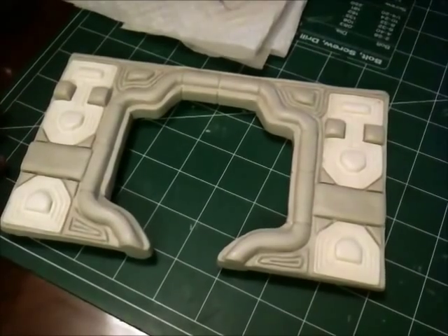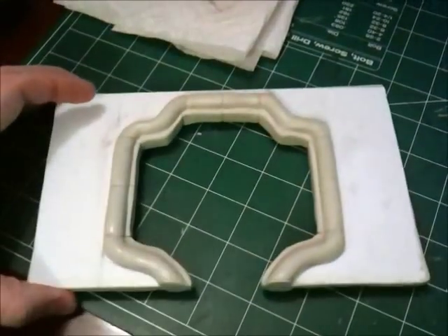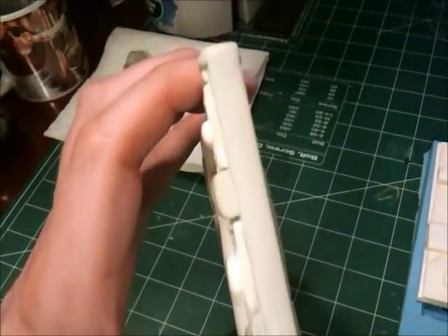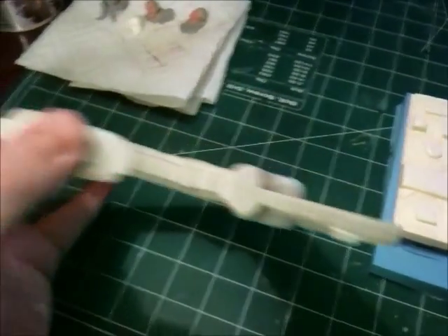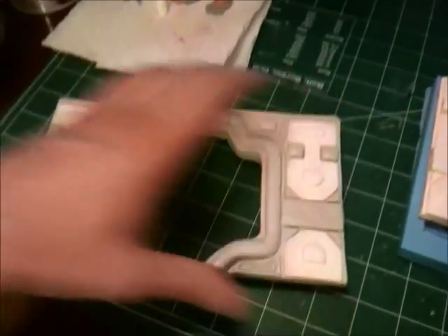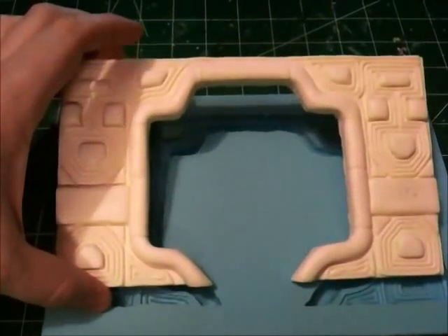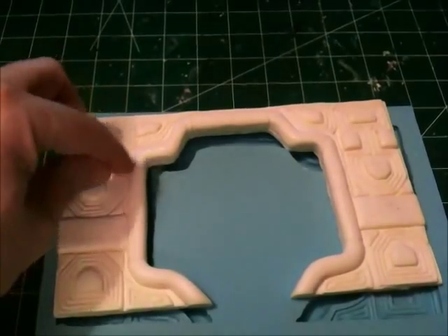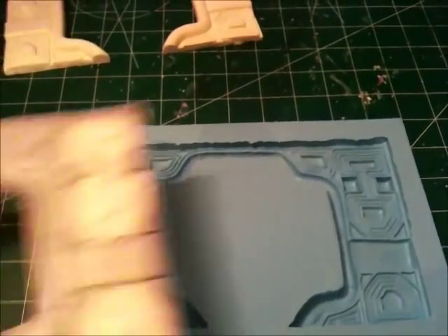My dilemma right now is that if I make a two-part mold I can make all the venting in the world, but I'm worried that since I can't see, I'm going to have air bubbles up here. So what I might do is do a one-sided mold for this side and then a one-sided mold for this side when it's finished — it has a long way to go — and then bring them both together, the same way I did here. These two pieces are glued together and I used Fix-It just to create a smooth wall around them with no seam lines, so it looks and feels like one piece but it's actually two. That way I get the best quality control. It may cost a little more in molding material, but if I can get something like this consistently it'll be worth my while. I'm not going to waste this much plastic on a bad casting because of an air bubble, and I'm definitely not going back and re-sculpting that.